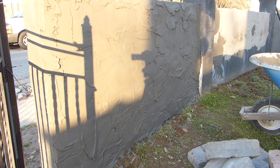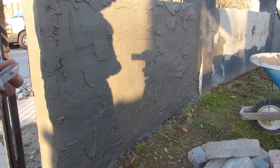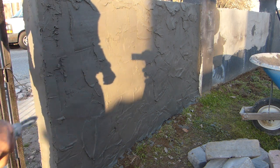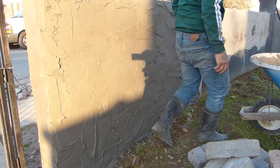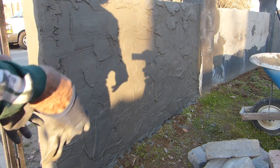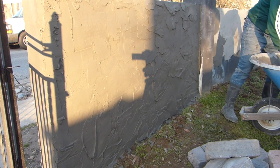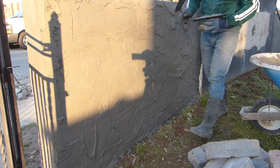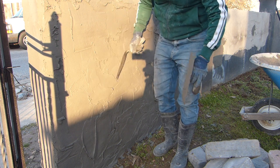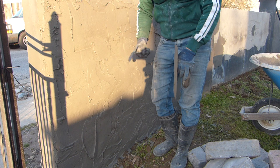I'm taking off my safety mask since it's wet anyway. I'll put the gloves back on because this stuff will dry your hands out and you'll be hurting later if you mess with concrete too long. Let me show you how you can just slap this on at this layer. I just do that — I want thick layers and I don't want to accidentally put a straight line anywhere that wouldn't look natural. It's inconsistently thick, which I want, because that's the profile of a stone.